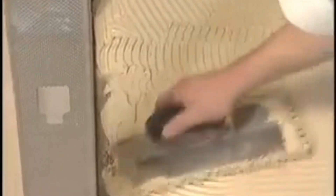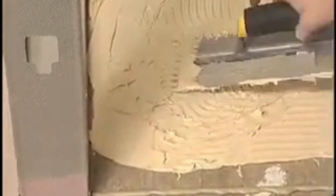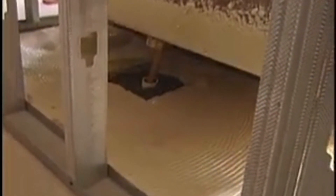Make sure the adhesive is applied all the way to the black line. Use a spatula to wipe the adhesive to an even thickness of three-sixteenths inch across the installation area. Move the shower into position in front of the framing pocket and lean it forward. Move the threshold into final position and lean the shower back into the pocket. Align the drain fitting into place, making sure the drain pipe is not pushing up the bottom of the shower, and that the no-caulk drain does not hit the side of the drain area cutout placing upward pressure on the drain area.